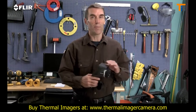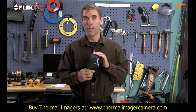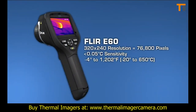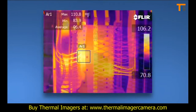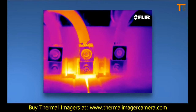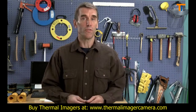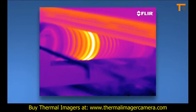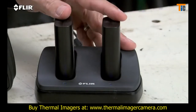And here we have the ultimate E-Series camera: the E-60. It has all the rich functionality and features we've already covered, and it has the best thermal imagery of the bunch at 320x240 — that's 76,800 pixels. Why would you want that? For even crisper definition and tighter temperature measurement accuracy. If your inspections involve a lot of smaller targets farther away, you'll need this extra power. Higher-res images also make it easier to show what you've found and are excellent for marketing purposes. The E-60 also has an extra battery and a dual-bay charger to keep you up and running all day.